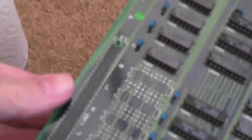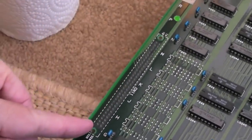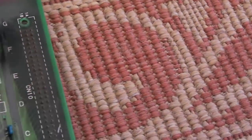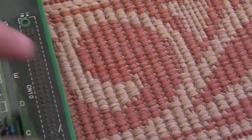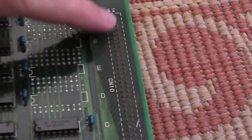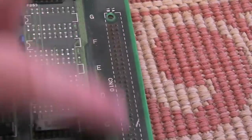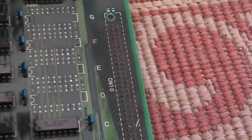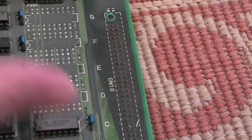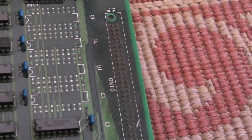And if you compare to the side I did over here, look at that side, that looks almost like new. And all I did there is after I finished cleaning around and using the toothbrush and stuff, it goes all red, and you don't get the dirt from in between the gaps there. So then use the fiberglass pen just lightly, just a few passes, and then brush it off with the toothbrush, and it looks like new. You get all that contamination off the surface there with the fiberglass pen.